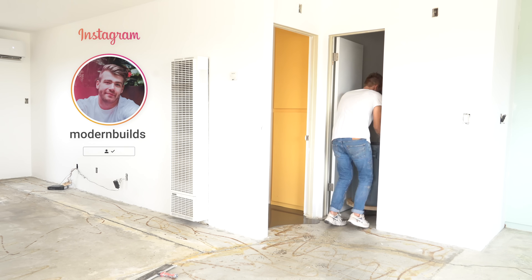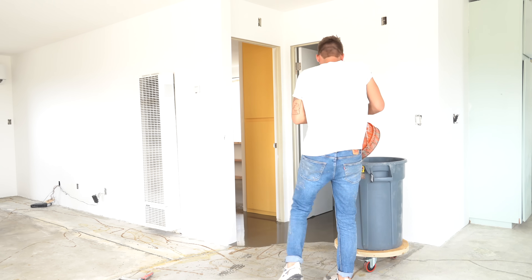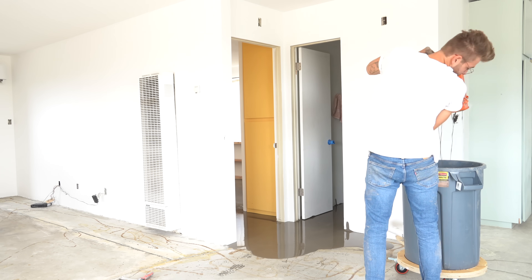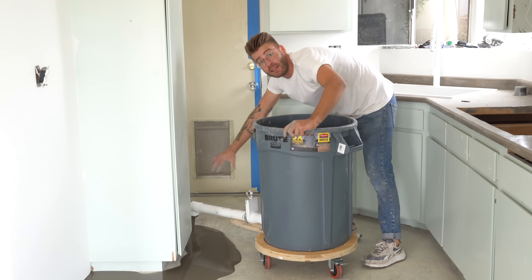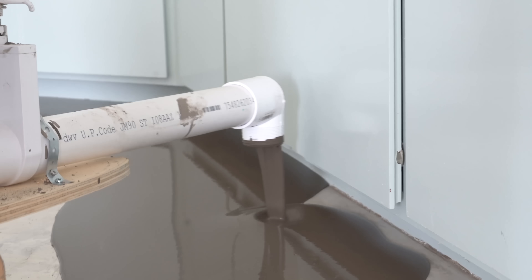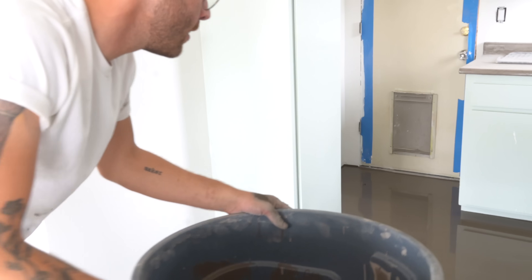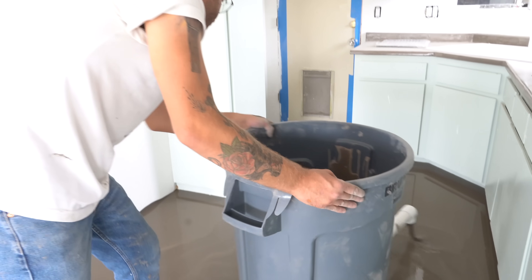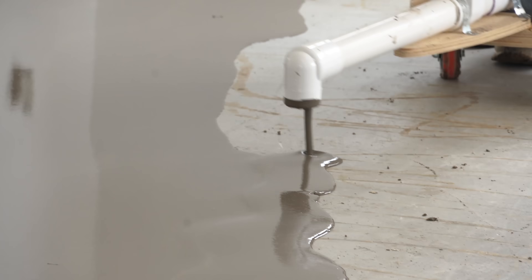Although it was really our only mistake. Make sure and follow me at ModernBuilds on Instagram to keep up with projects in between videos. This time I made sure that the refill was quick and I was back to pouring right away. Before we get trapped, I'm going to do the back corner of the kitchen, and I want to make sure I keep the edges wet, so I'm letting it flow out more quickly now. I'm starting to like this random kind of pour pattern — working the concrete out in a radius from that center point, it made a really cool geode pattern going into the kitchen area and the living room.